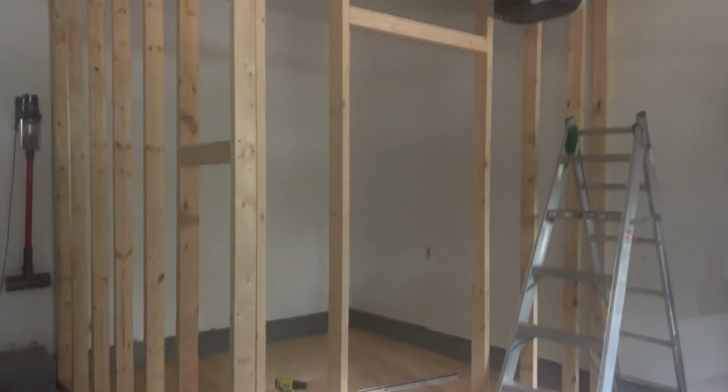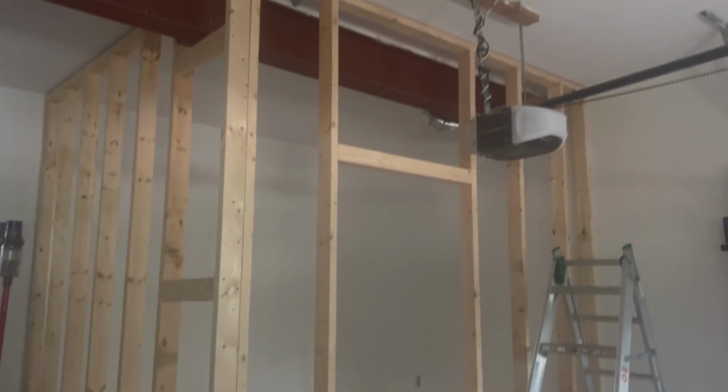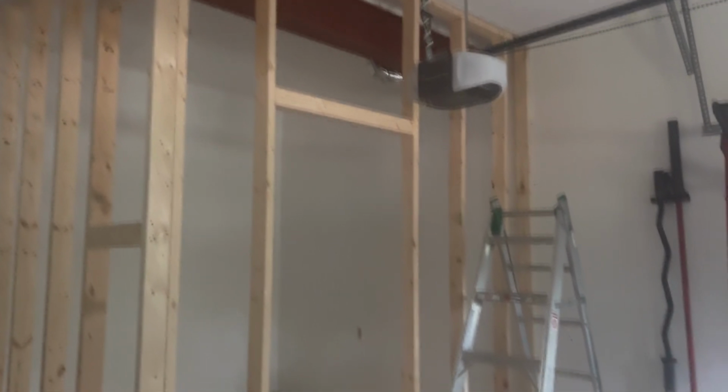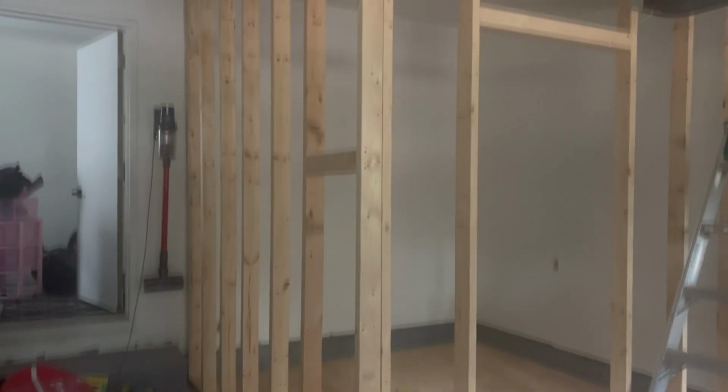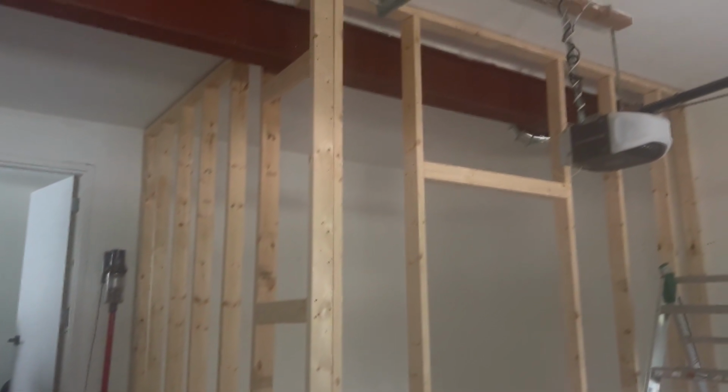From there, you then have to build up the walls. Framing up the walls, 16-inch studs, is relatively straightforward. You just measure it out, figure out how it's going to fit. I had to put it around one metal beam, which wasn't the easiest thing in the world, but then you have your walls. Then comes the worst job of all.